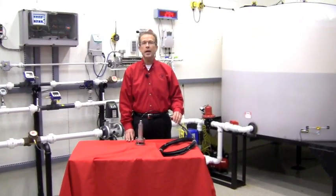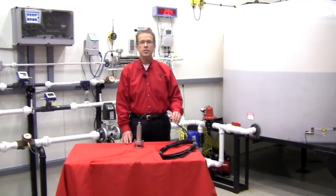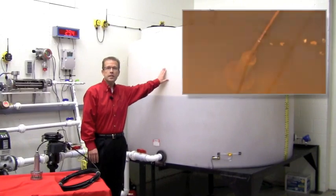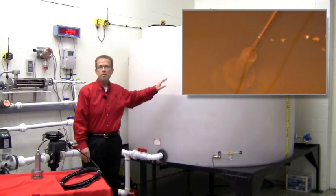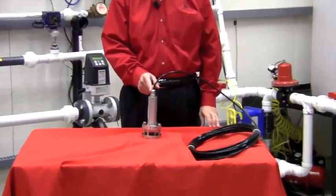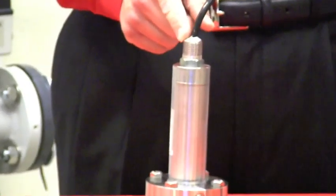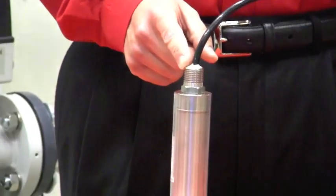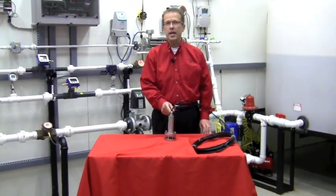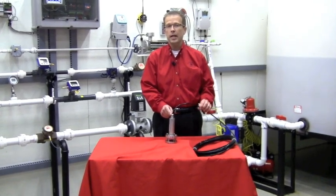There are several methods available for mounting the PBLT2. The transducer can rest on the floor of the vessel with no additional connections, as we have here at the Gilson Engineering Flow Lab. A more secure and stable method is to utilize the half-inch NPT on the back of the unit. This connection allows you to use rigid conduit, either metal or plastic, to secure the unit. In installations where overhead space is tight, flexible conduit can also be utilized.